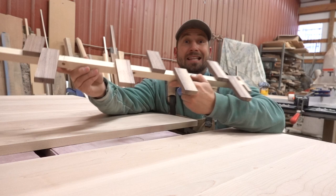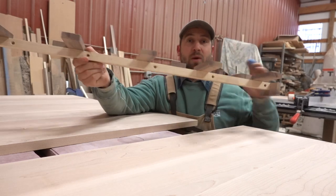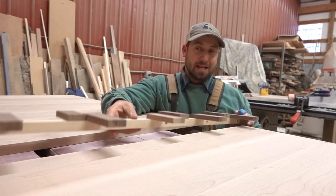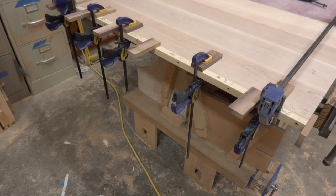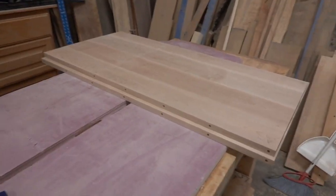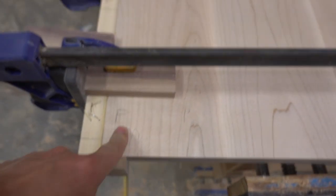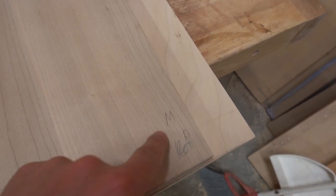So I had to come up with a way to transfer accurately, and this is what I came up with. Make yourself a jig that can reference off both sides so you're not having to flip it around, and that way you can transfer all your dowel pins or whatever you use for the leaves. Now I'm getting ready to drill with it. I've already done two of them — the male and the female. Make sure you label everything. I marked this one as reference and F for female, and this one over here is also referenced F for female. This one has my reference point where I'm referencing my stop block, reference and male — just so you don't get those things mixed up. Those are little details that you don't want to mess up.